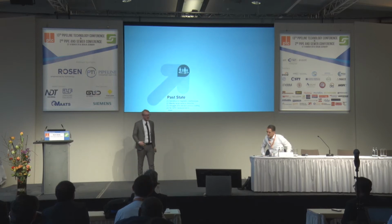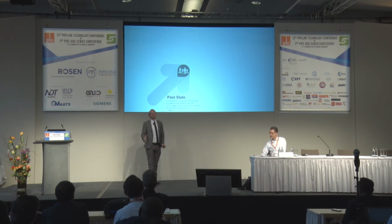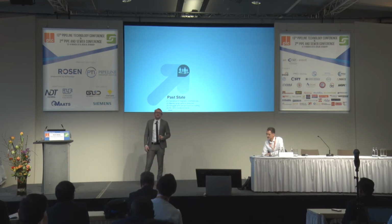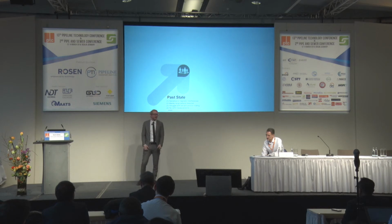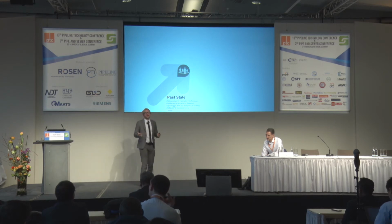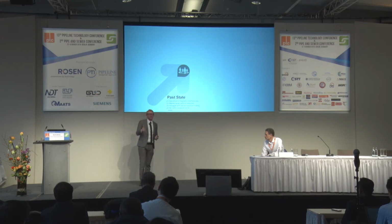So what was the past state? Before 2015, the inspection technique was very sensitive to magnetic field interferences, so we could merely detect large defects. We struggled with old and corrosive coating, and there were no GPS measurements. This was a very tricky point, because when we had 500 meters of plain field and we were using a measurement tape and we located a defect at 276 meters, how would you, as a pipeline operator, find or pinpoint the actual location of the defect?